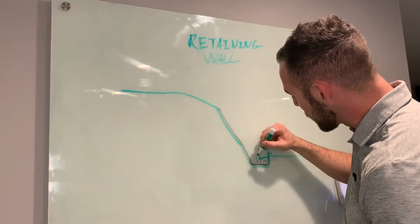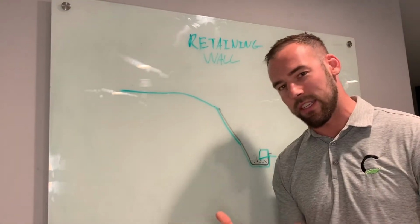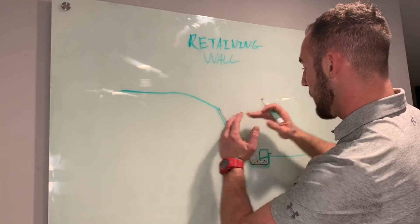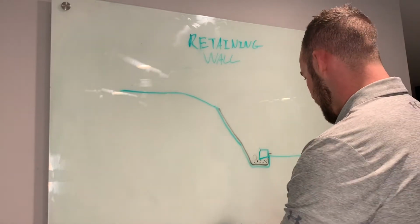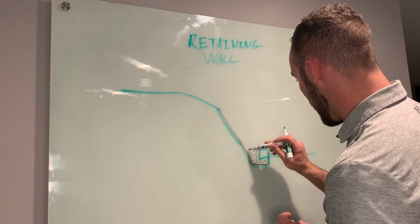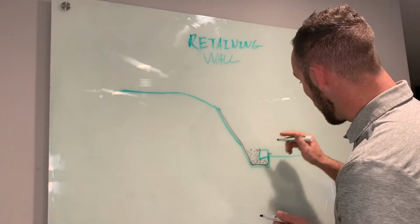It's going to go laser shot into this drain pipe, and then obviously we will designate a destination for it, but it's going to spit that out somewhere instead of having water build up here to then frost heave and expand and push this wall over. So once I get this drain tube in here, I can get some more of my drain stone in here. Now I am up to the level of that brick and I can compact that a little bit.